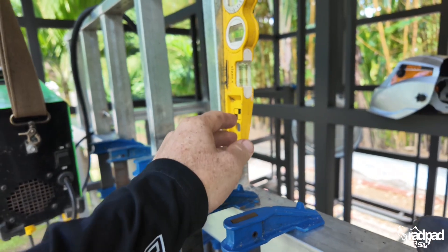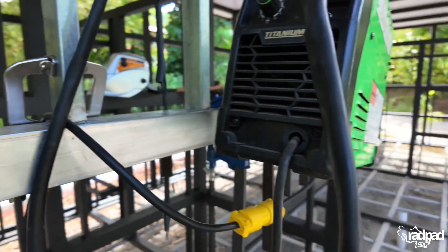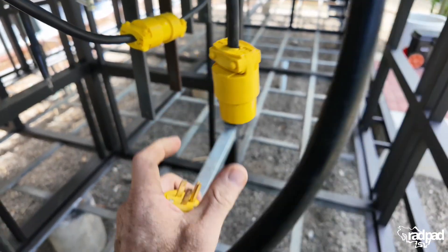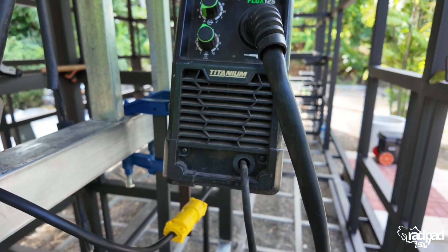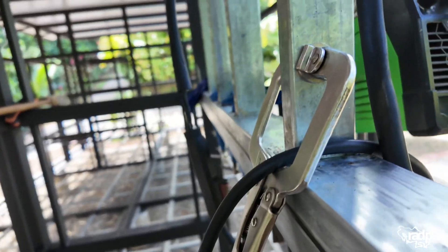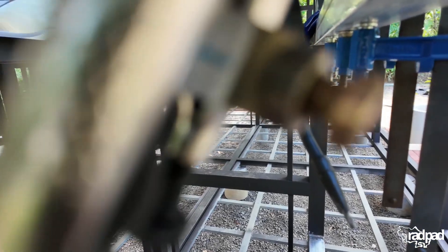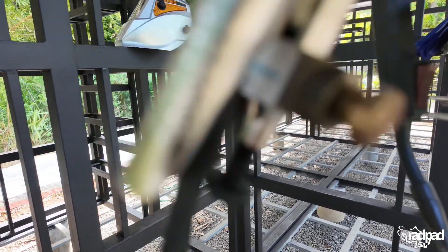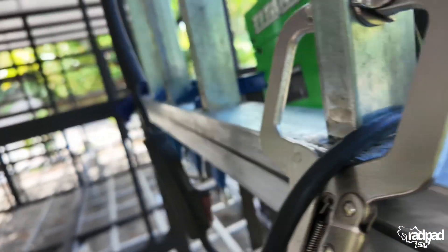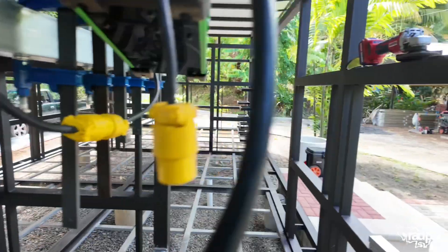A magnet level — totally crucial. The welder itself, and I made two additions to the welder. One is the ground cable now detaches, so when I move the welder I don't have a big long cable. I also took off the ground clamp and I use a set of vice grips with an earthing rod attachment — the copper one. That big vice grip can clamp to almost anything, three inch and two inch, which is important for this job.